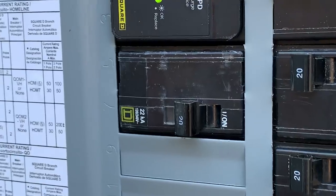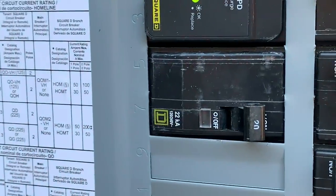Once all of that is done, I'm going to turn the breaker on and send power to the unit. Within about a minute, you should hear an audible beep from the device that lets you know everything is good to go. If you don't hear a beep, there's definitely a problem — check that your current sensors are facing the same direction, make sure the leads inside the breaker are fully landed and not loose, and verify that the leads connecting into the monitor itself are hooked up correctly. At this point we still need to connect to the wireless network, but this beep confirms the unit is installed correctly.